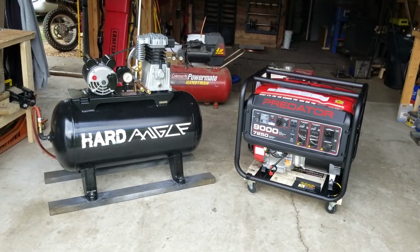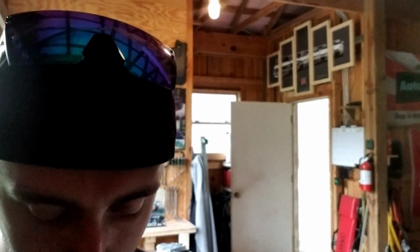New air setup. I didn't know how much oil this giant generator took, so I bought 3 quarts of 10W30 full synthetic 4-stroke oil. I believe it doesn't have all the detergents in it that engine oils have, I'm not sure. I just bought the right oil. I bought 3 quarts. It took 1 quart, so I have a couple oil changes' worth. I think I'm actually going to take care of this generator because it costs so much money.